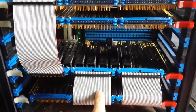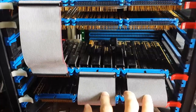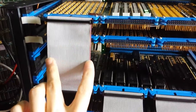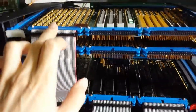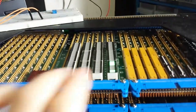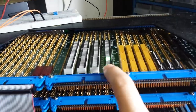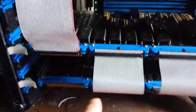These cables right here are passing the CPU signals and also display signals. So these are CPU control signals, and these are just for display. The status register, for example, comes from this board into the front panel board and is displayed here on the first row of LEDs.